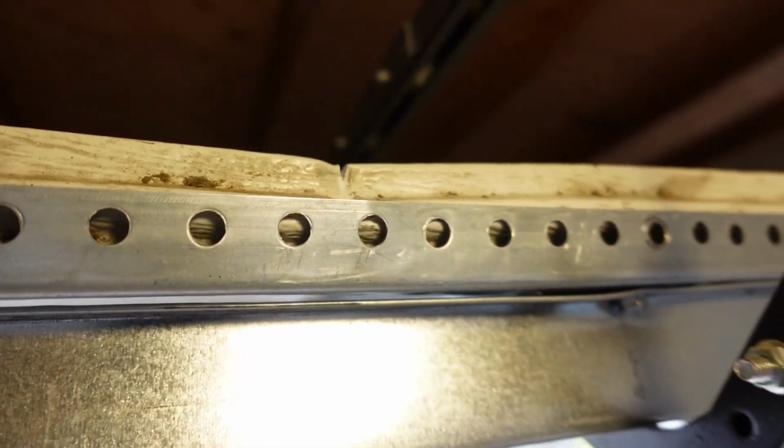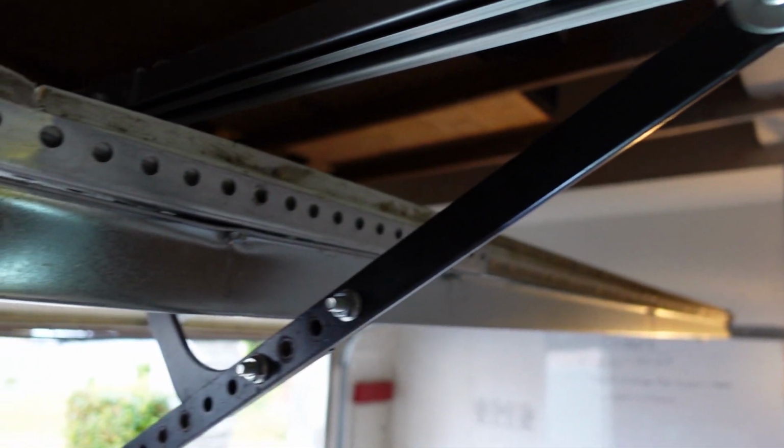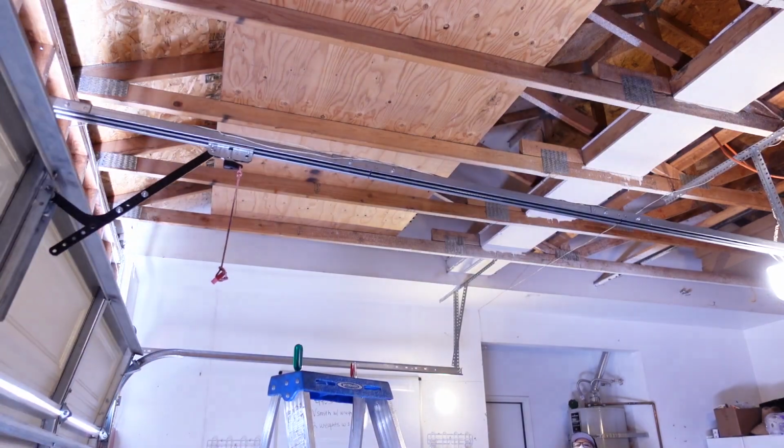Hey party people, we're out here with a customer who has a garage door whose top section is unfortunately very compromised. In fact, that top section was bowing and bending. It was no longer allowing leverage for the garage door opener's J-arm to close the door properly. I had to do a number of things to get this opener to work with the door based on the circumstances, because the long and the short of it is, if you have something similar to what we're experiencing here, your best course of action is replacing the garage door.